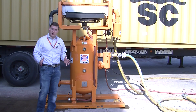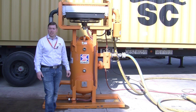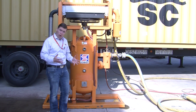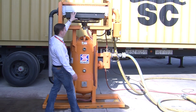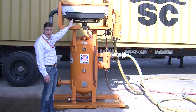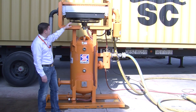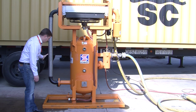So how does deliquescent desiccant work inside an air dryer? Say today is an 85 degree day and it's quite warm and humid. The air coming out of your compressor will be about 250 degrees because it heats up a lot. It comes down your bull hose into the inlet tank and then through the after cooler. If your after cooler is sized correctly for the amount of air flow, it would effectively cool that incoming air to 10 degrees warmer than ambient. So on an 85 degree day, coming out of the after cooler the air will be 95 degrees.